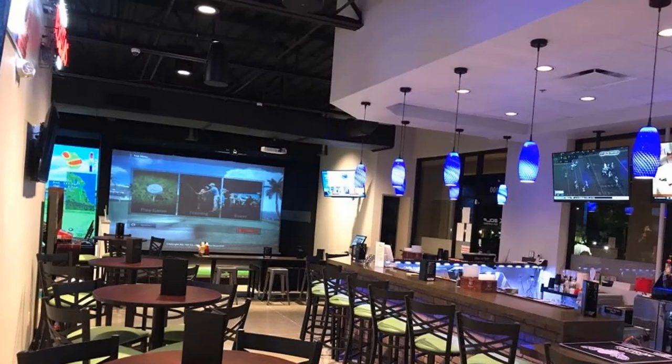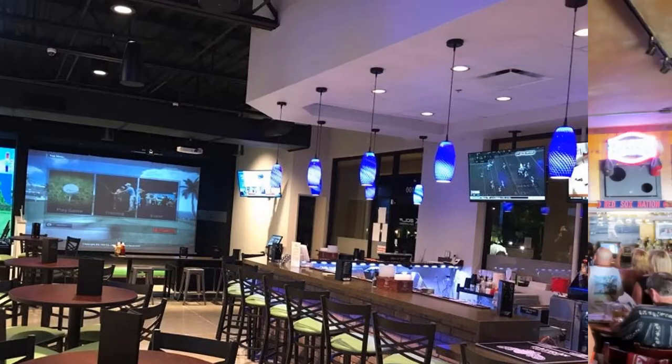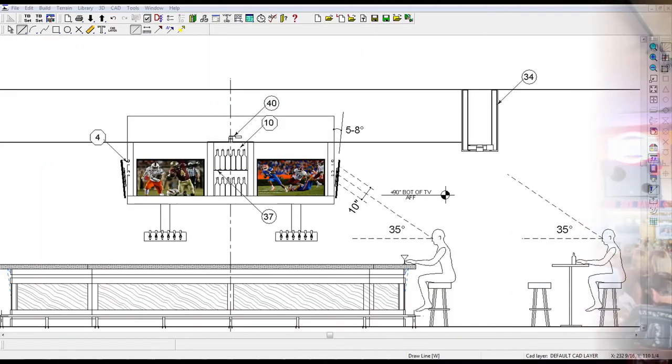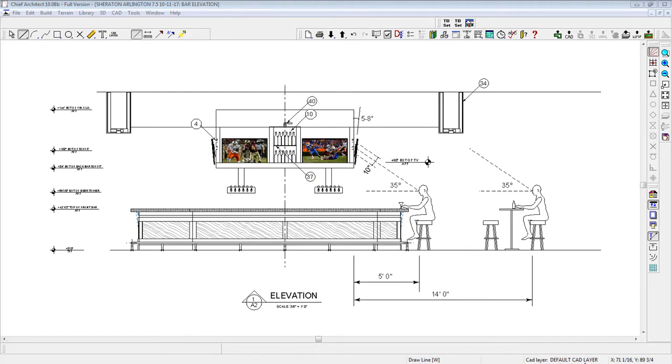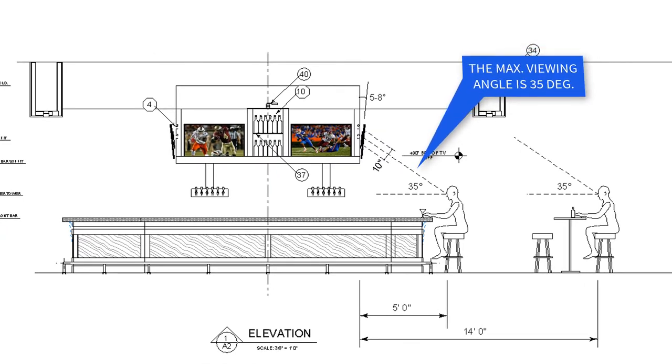As for the correct installation height, there's obviously a difference between optimizing a TV for a bar and one for your living room. In the case of the bar, you'll have people of differing heights and distances. And although this would seem to add to the difficulty of planning, it actually makes it easier as patrons will move to the spot they find most comfortable. According to architectural standards, the goal is to set the height of the TV so the people closest will see the middle 10 inches, as shown in this plan. By the same standards, the best forward viewing angle of the patron is 30 to 35 degrees. This implies that the ideal height is more critical for the people closest to the TV because their viewing angle is the shortest.